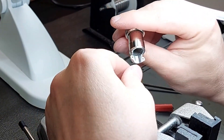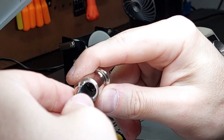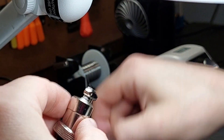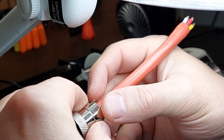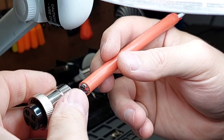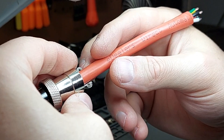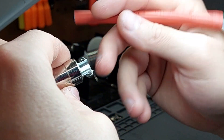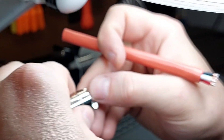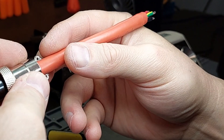Here's one that's been properly machined — you can see how everything has been deburred. That's something a lot of guys don't take into consideration: all of this needs to be deburred. Why? Because as I just showed you, this housing rotates. So if it's rotating around your casing, the last thing you want is to be basically marring up your casing. We don't want any type of exterior casing degradation. All the edges have been filed down so everything is like butter — just slips in and you're golden.